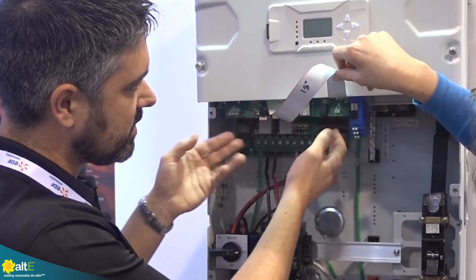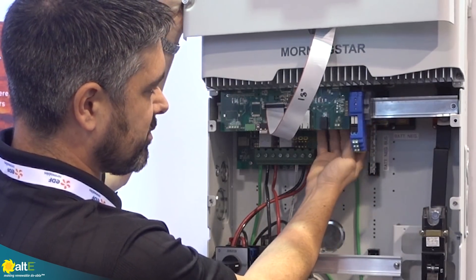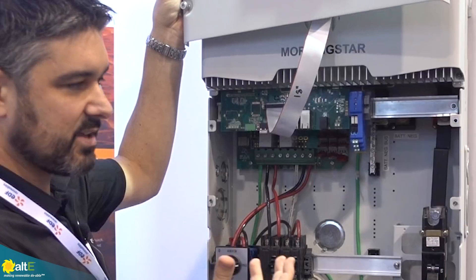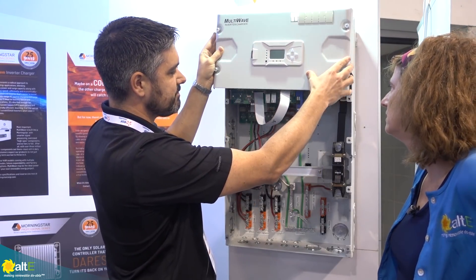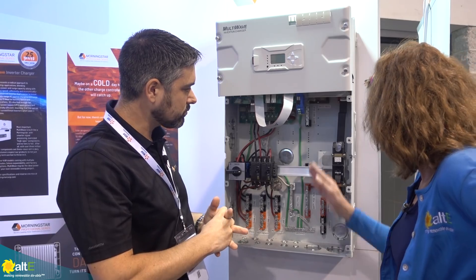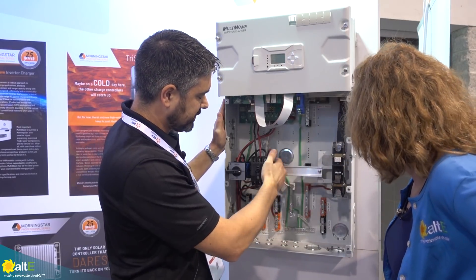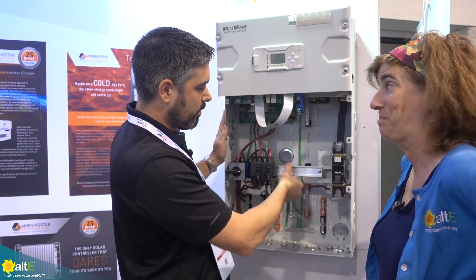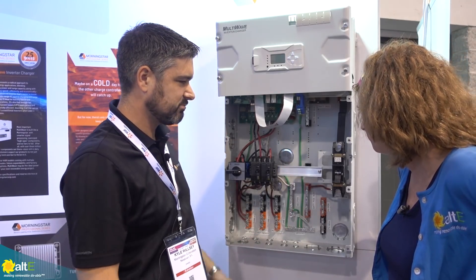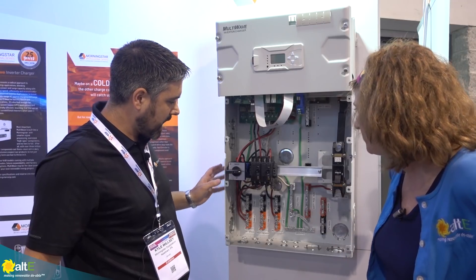Of course, there's the power electronics stage — a little hard to see, but mounted up underneath the heat sink. There are a couple of toroidal transformers that sit behind the heat sink, and those give us the surge capability. What's noticeably absent is the big heavy transformer that adds weight. This is more of a high-frequency hybrid design that eliminates about 30 pounds out of the unit. And we've got our DIN rail here for the BOS expansion — plenty of space. These are actually custom-made DIN rails; we weren't satisfied with standard ones due to too much flex, so we built a heavier-duty extruded aluminum DIN rail that feels pretty beefy and industrial. There are also knockouts on both sides.